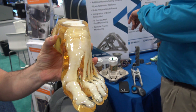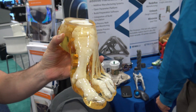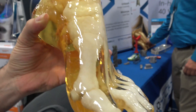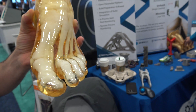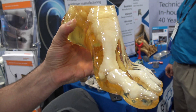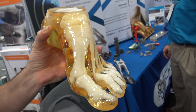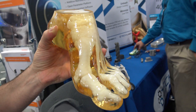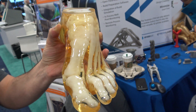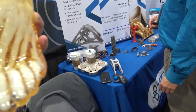What kind of material is that? That is PolyJet — it's going to be clear or white. They do what they call digital materials. Just like your inkjet printer at home mixes different colors to get a certain color, this does the same thing. So if you have something really low on the Shore meter — really flexible and squishy — they can mix that with a firmer material to get something in between. Also, if you want transparent versus translucent, they can mix the two together.